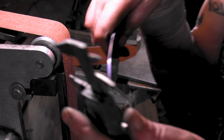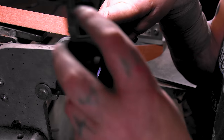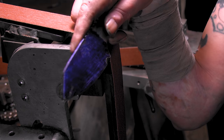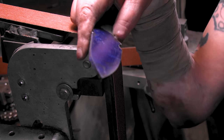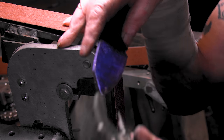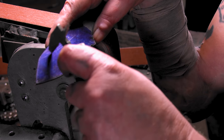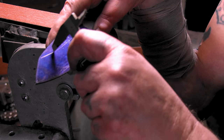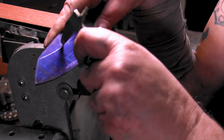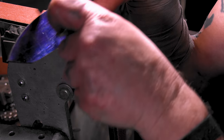And I almost forgot this part. Take some old calipers. Look, this one doesn't even have a battery, and it has broken glass and all that. You can use a scribe if you want. Make your own scribe. There are many YouTube videos on how to make scribes. But I'll be honest, I've been using these for forever. Just extend them to how you want it. Boom. Scribe your line. Boom. That way you know you're even.